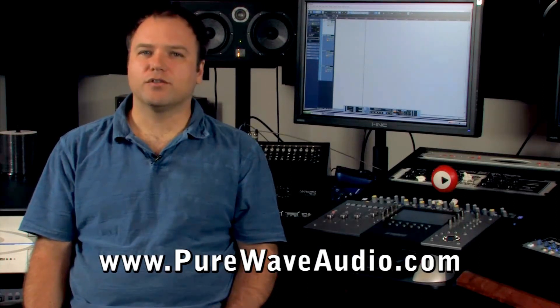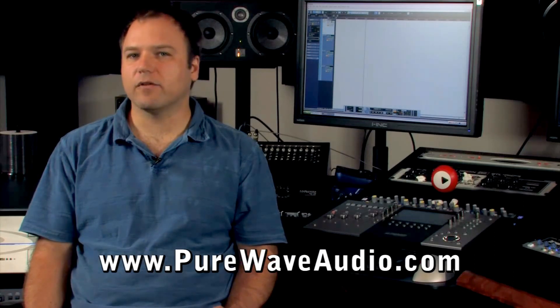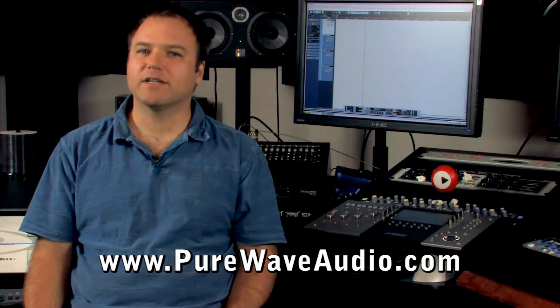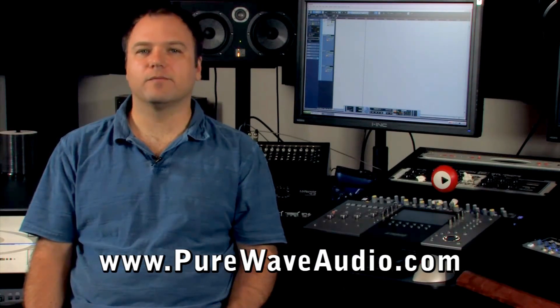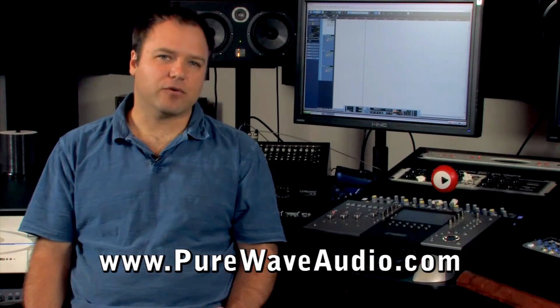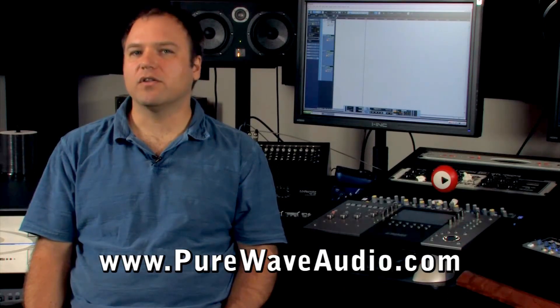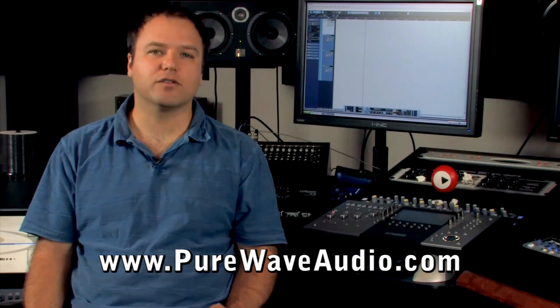If you want an all-in-one solution, a digital console with many mic pre's and DSP for effects will cut down on the space in the room. No racks of gear and virtual fader banks keep it all right in front of you. After the mic pre's, everything stays in the digital domain all the way to the DAW. If you choose to mix on the console, the audio still never leaves the digital domain, and total recall will also be available.